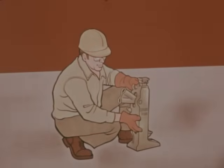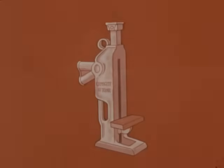There are several good points to remember when lifting a load. Always make sure when raising a load that the jack is in a true vertical position and that it is resting on good footing. Always place a thin piece of wood between the lifting portion of the jack and the load to prevent the jack from slipping on metal-to-metal contact.